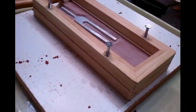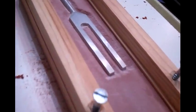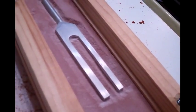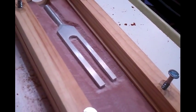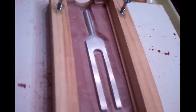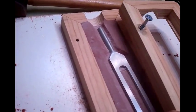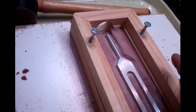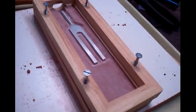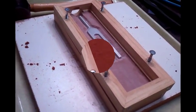I made this flask out of three-quarter by three-quarter wood. I did mill it out so there's a little edge down in there — you can see that. I ran it through the table saw and just took that wood that's missing there, but left that little bit on the bottom so there's something there to separate the two halves. Then you put it together and I just ran screws straight through it — there's no pins or anything like that. It should just screw down nice and tight and then it should work.